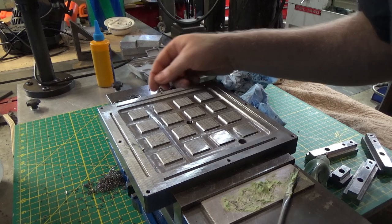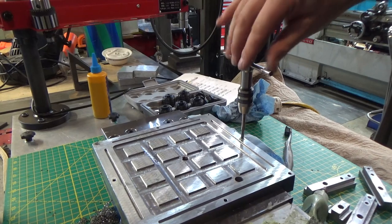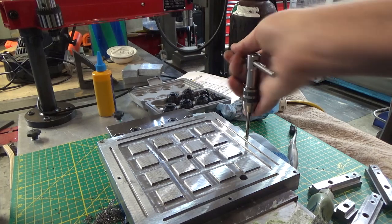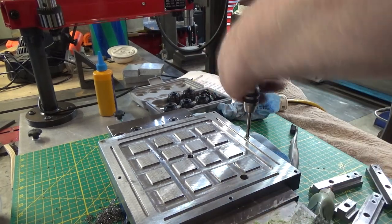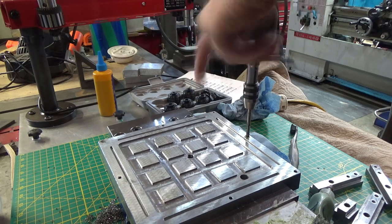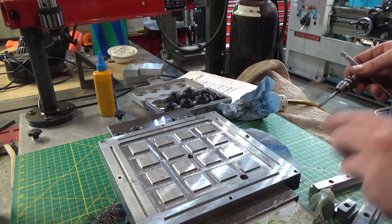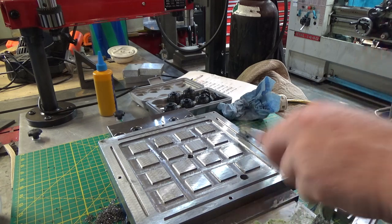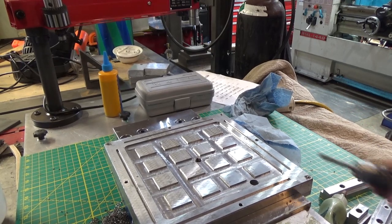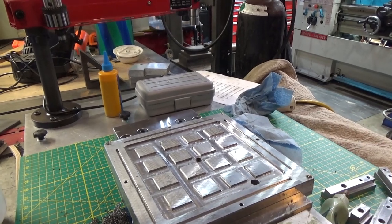Well, this was a rough experiment. I've got two broken taps here I have to remove, and I'm resorting to manually tapping because there is a ton of force on this. This is tough — I think I should have gone for less than 70% thread engagement, maybe 60%, because it's struggling even manually. I can see why it broke. Even hand tapping I broke another one — absolutely insane. I was going slow and easy and still broke a tap. I don't know, maybe I got the hole size wrong somehow.